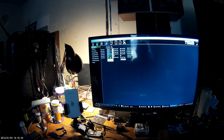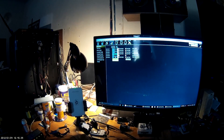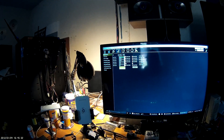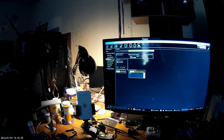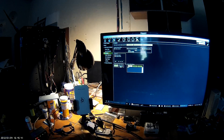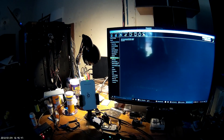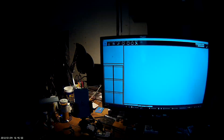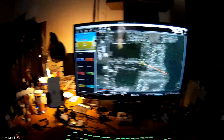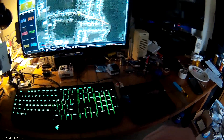It's going into loiter. It's pointing in the right direction — I guess I need to do a restart on it after flying around a little while to see if that gets the compass calibration correct. Let's try a restart, because it's landed and pointed in the right direction on the map.